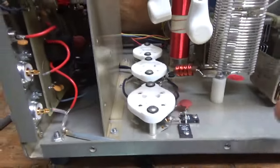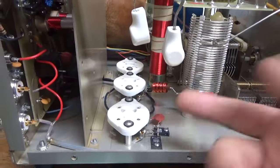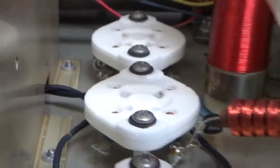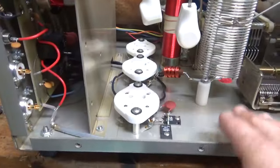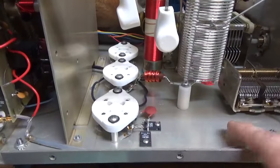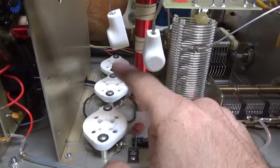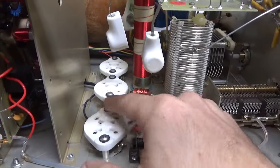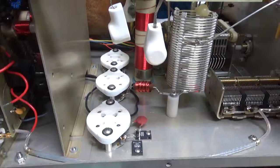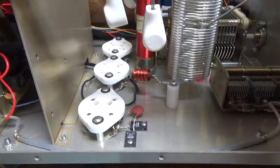I see someone, the person who put these gas discharge tubes in must have thought that the tube sockets were in series, I'm guessing, because they put the other gas discharge tube over there, and they're not the right ones. They're rated for 120 volts instead of 150, so both will come out. I'll fix the solder work over there, fix the solder work over here. And I always put them over here, right here, across the filament of one socket, because all three tubes are in parallel. The filaments are in parallel. So I'm going to solder these connections and start undoing all this, and I'll see you guys soon.